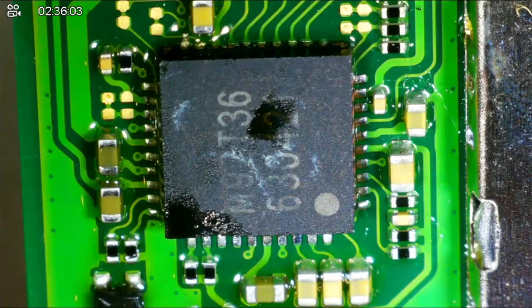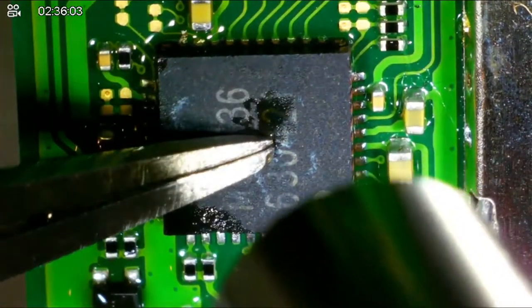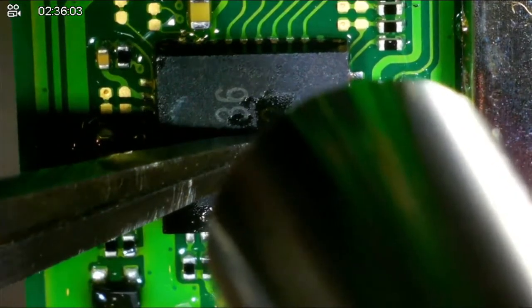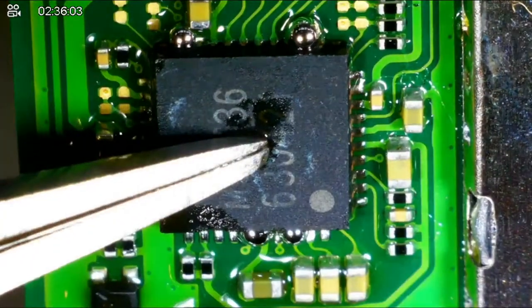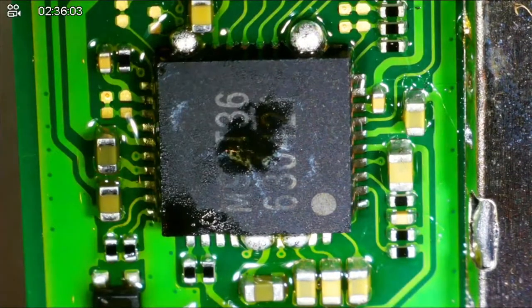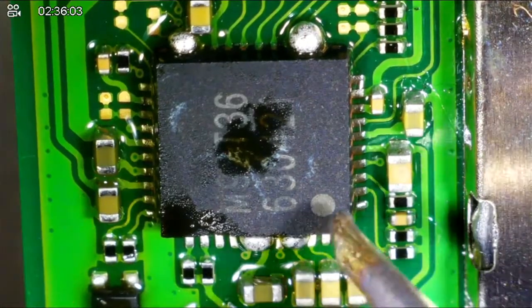Push down on the chip? Is that not. Okay. Now if you push down gently on the ramp, up the air to 50. Okay. So let's get back in there and push down on the chip here. Okay, so now I got solder blob squeezed out. That's what I was looking for. Okay, so now let's clean this up, and I still don't see any components missing.